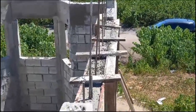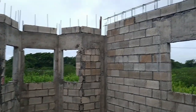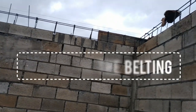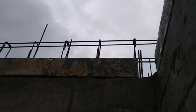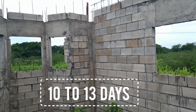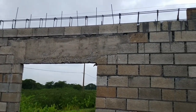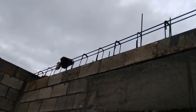Here's a view from the top of the building after the lintel was completed for this portion of the house, captured by our builder. One thing about this team — they work quickly, because by the time you blinked, the row of block was laid just above the lintel and the cagings were already going down in preparation for casting the belting. All of this process — completing the columns, boxing up the lintel, casting them, pulling them down, and getting ready for belting — took place during a rainy season, all within about 10 to 13 days. They reused the same forms for lintel and boxing.